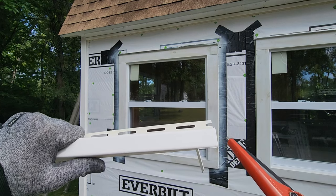I'll duplicate this side piece and then create the bottom piece. The bottom is going to be the same length as the top, with full notches on either end. Here is a finished window. A little bit of advice: the top piece shingles above the side piece — any water that comes out the edge runs into the side piece. The side piece shingles over the bottom piece. Think of it like roofing shingles. We have that tab that comes under and tucks under the bottom piece, and mitered cuts on either end. That is a completed window.